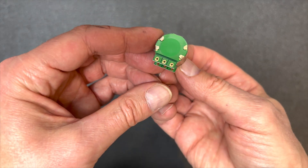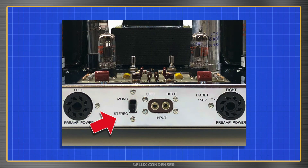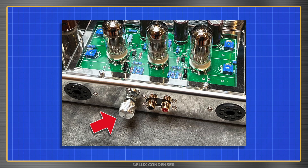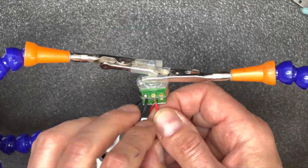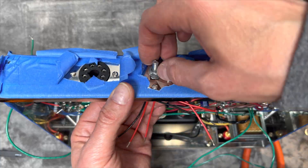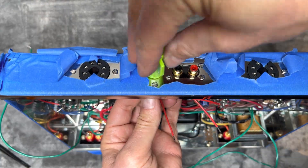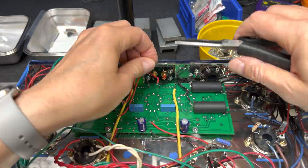This potentiometer is for a modification to the ST70 that I highly recommended to Dave. It replaces the traditional front panel stereo-mono switch with a level control. That's a fantastic addition because now you can use the amp without a preamp — just plug a source into the inputs like an iPhone and control the volume via the level control. Note these cool plastic sockets for scratch-free installation of pots and switches; you can learn more about them in my weekend update video, link in the description. Looks like we've got a lot more wiring to do.